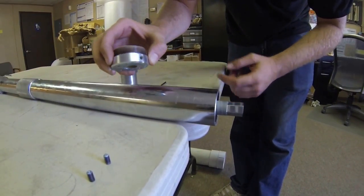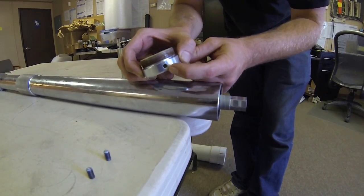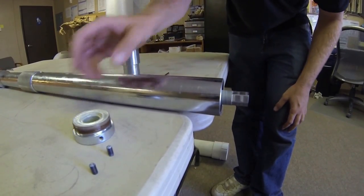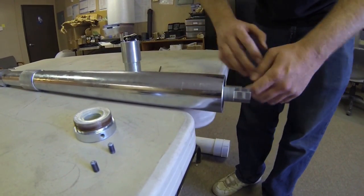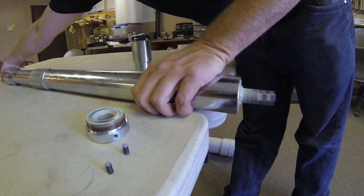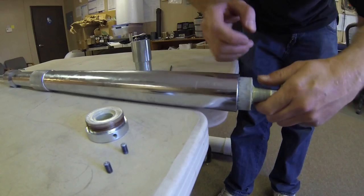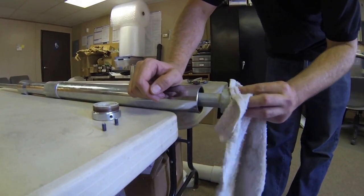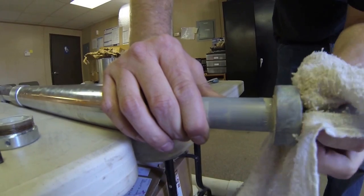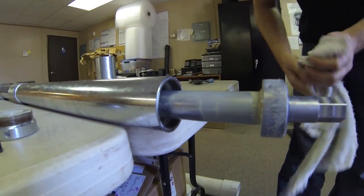When removing the end cap, there is a plug on the inside of one of the set screws. Be sure not to lose that plug. Once you have removed the end cap, you will slide the boring bar back a little bit to expose the bearings and the clip. To make working conditions easier, you'll want to clean the area you're working with to expose the clip.